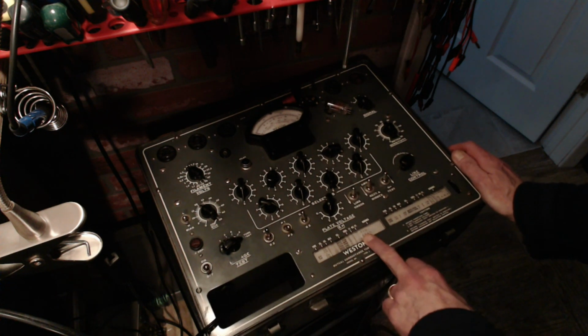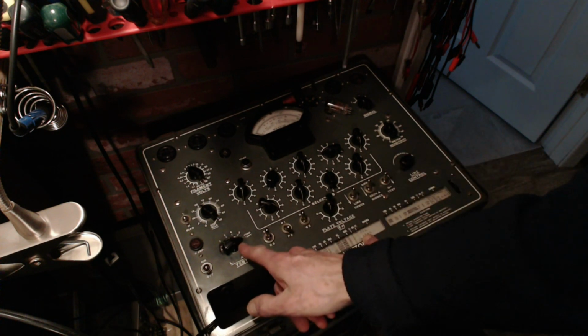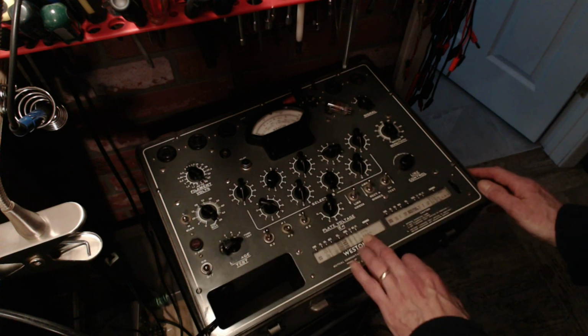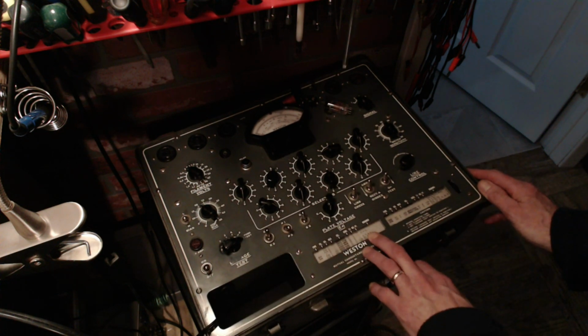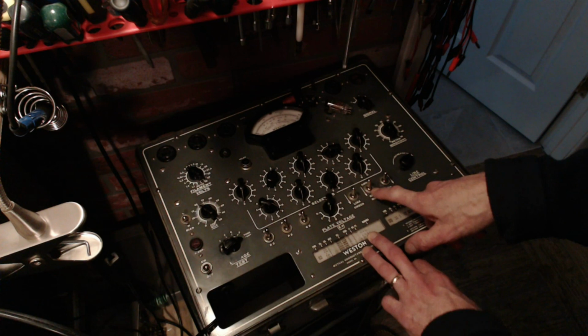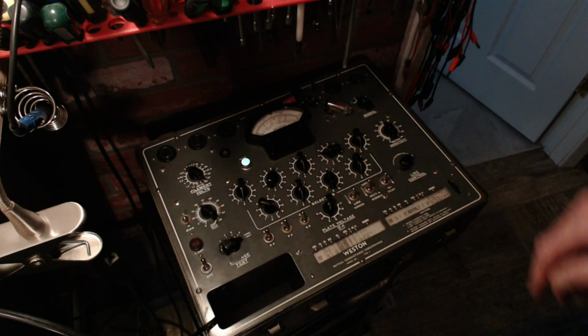So it has a couple of notes here. One is note F. Note F usually means you get a short appearing on number 5 here. It may not be number 5 though. And then it's a two-part tube. It's a double rectifier, so we do a P1, P2 and do two tests on here. We're all set to go. Oh, I didn't put the tube in. We're not quite all set to go.